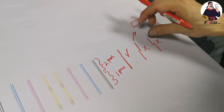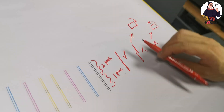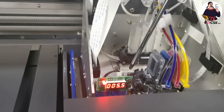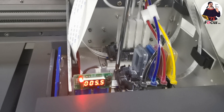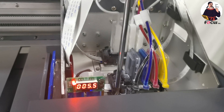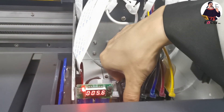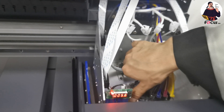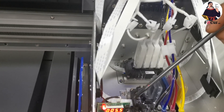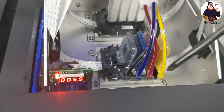If the result is shifted to the left, we need to adjust the print head to the left — rotate it a little bit — and the lines will come into alignment. We go to the print head where there are three screws: one, two, three. We loosen those screws and adjust the print head a little bit, rotating it to make it the correct position. Then we do the test print again.